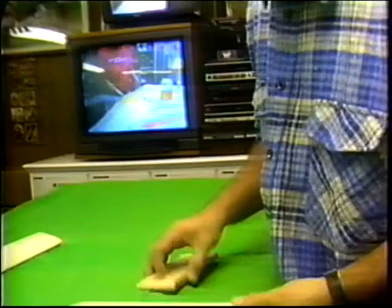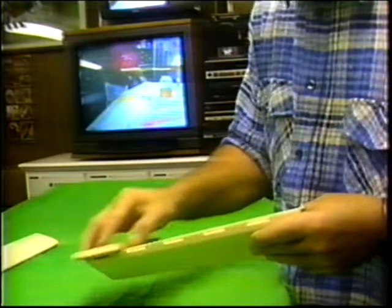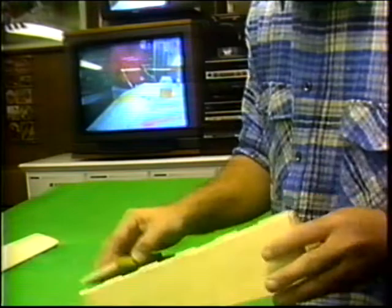Now with all the parts final sanded, obviously if you have some little spots you have to fill in, we're pretty lucky on this, we don't have any. Fill in the little spots. DAP is a good idea to use on that. Any place you don't have a reverse curve, DAP is fine. You know, I wouldn't suggest it for fillets anymore.